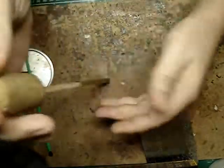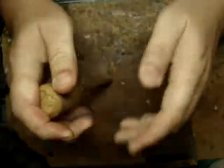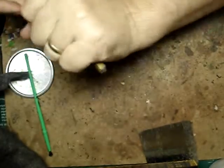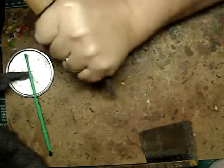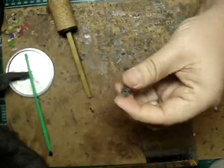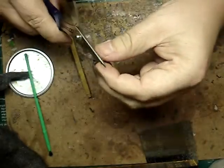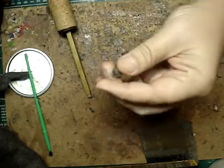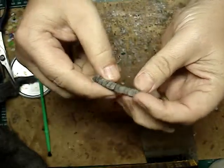Keep fitting your steel wool in, and once you get it to that point go to compaction before it comes out the other end and messes you up. All I'm going to do is compact it down. It takes quite a bit of force — I have to hold it like this and hit it to force it out — and that will give you a compacted bale. That's what it looks like.